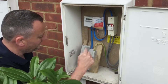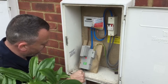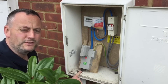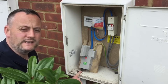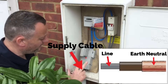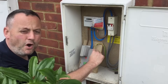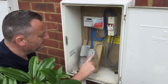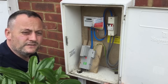The 16mm earthing conductor is connected into the side of the cutout section, and it means that it is actually connected to the neutral from the supply cable coming in. It separates with the two conductors. This is a concentric cable - one that has an aluminium centre line conductor and a combined protective earth neutral which is copper, which actually looks almost like armour of the cable. It comes out and becomes both our neutral and our earthing conductor. Inside here is a solid block which contains the terminations for both the neutral and the earthing conductor.